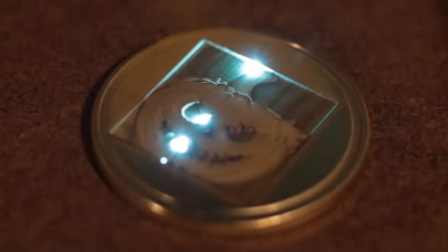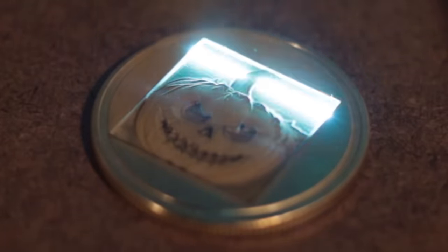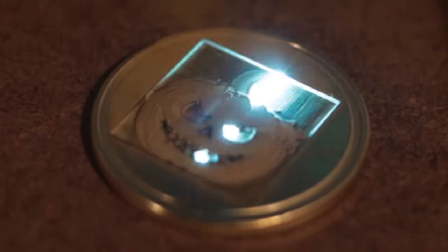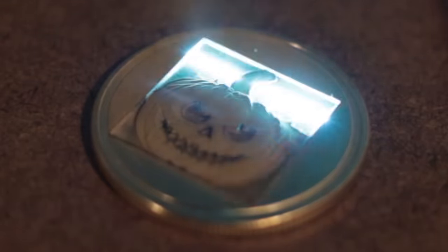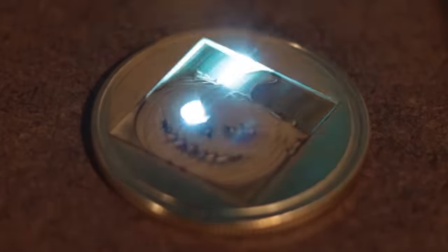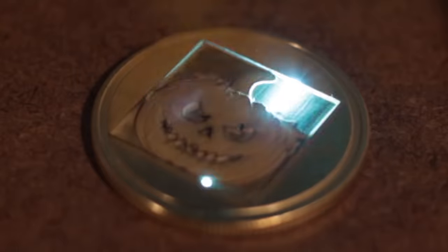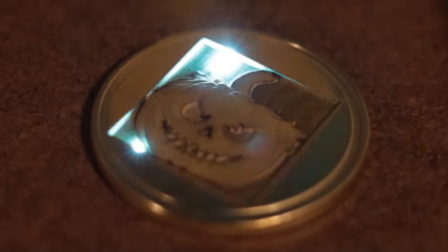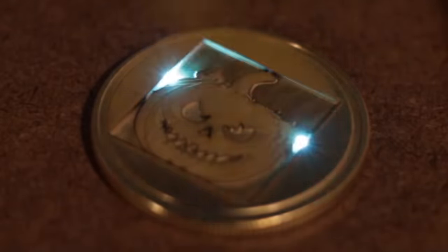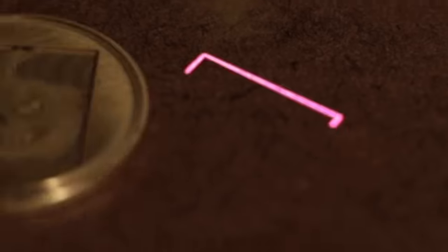This gives you a visual difference of why this is very different from a normal image being engraved and just repeated 256 times. The pass count on a 3D sliced mode image should be seen as more of layers than passes. 8-bit color can carry 256 different colors, which is why we continue to repeat that number. It is why it is ideal for the number of passes to start with in most generic use cases. By increasing the pass count beyond that, it will begin to duplicate layers, which may assist with achieving more depth if needed. This is a great way to achieve more depth if you are limited by the power capabilities of your laser, or simply like the finish you are getting and can't get the desired results on the material by increasing the power.